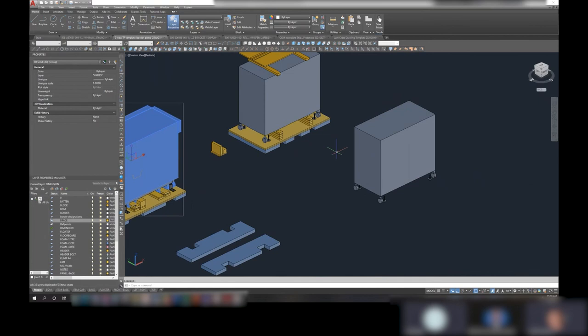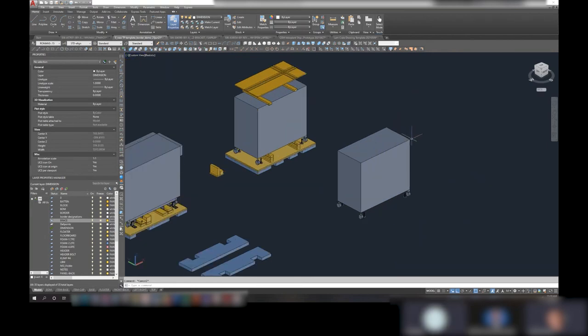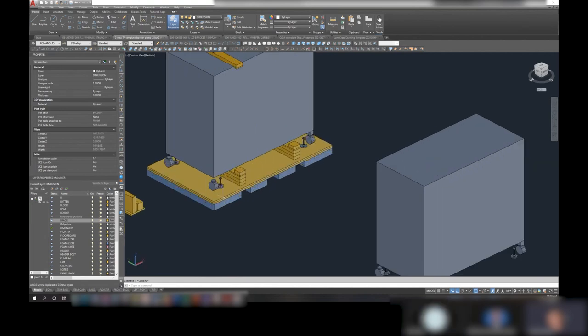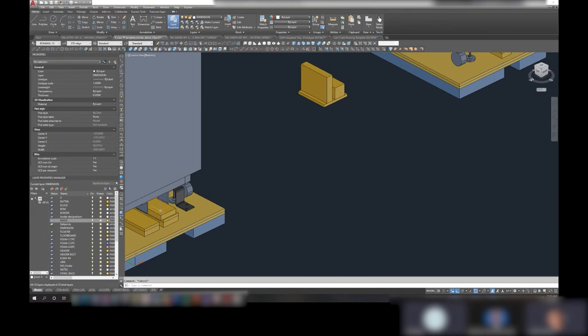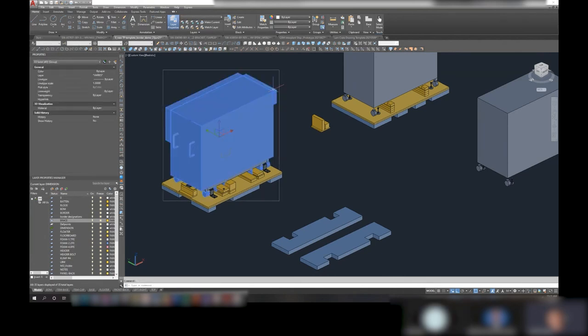When you're doing design, when you lay out, from my experience, the step I normally do is I will simply sketch out whatever I want. Those sketches I don't make so precise, I can be off by 1 or 2 inches or maybe 1/2 inch. This I don't pay so much attention to, a rough one. But those areas where you want to put LBM, you must be more precise, especially those things where you want to use brace and bracket. All those protruding items must be precise.